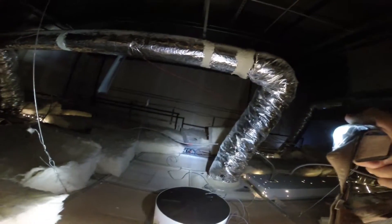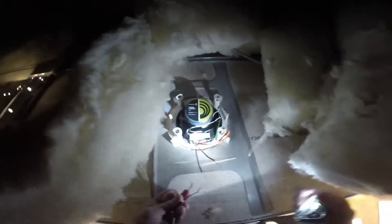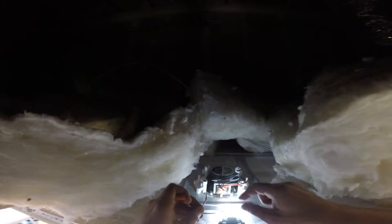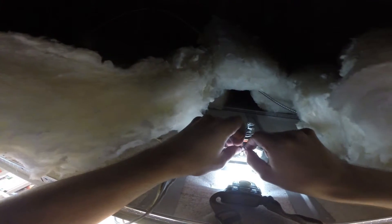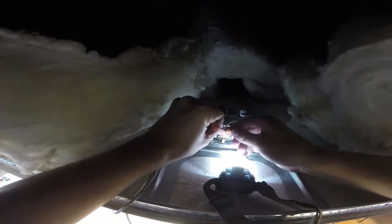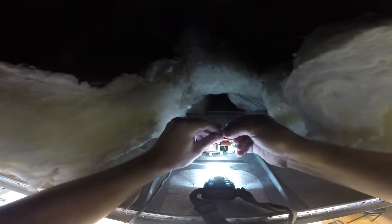Back there is above the AV closet. The wire goes from there to that speaker, then to the sub, and we connect in parallel — all of this is in parallel. We're going to connect our last speaker here using that 10-watt tap. I'm just going to be using wire nuts — no soldering required. I've stripped all four of these wires and twisted the strands of copper together, then used a wire nut to connect ground to ground, and another wire nut to connect the 10-watt tap on the speaker to the output of my amplifier.